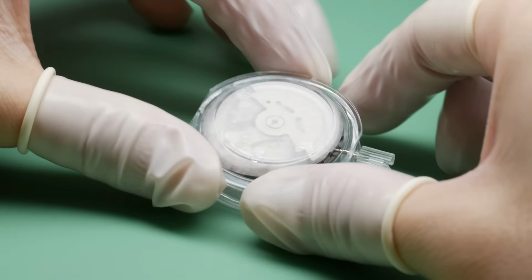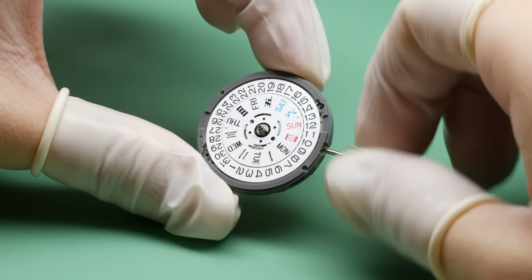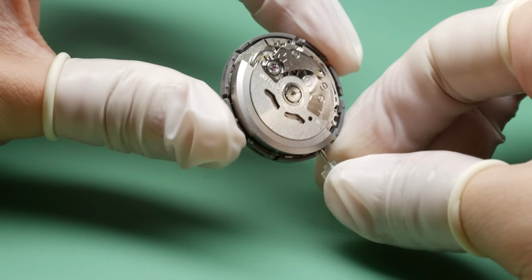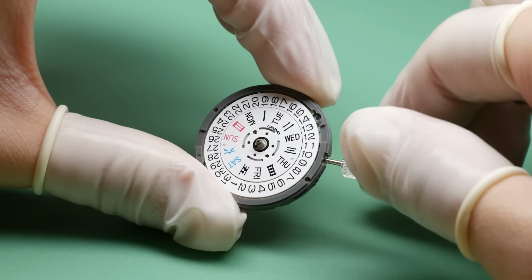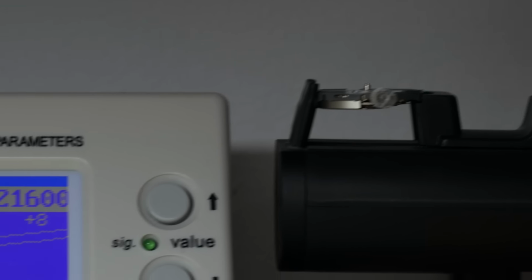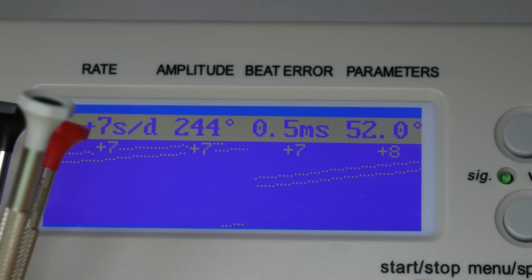Alright, so if you're familiar with my channel, you know that I like to start each build with the movement. Today, I'll be using the Seiko Instruments NH36 movement, which hacks, hand winds, and features a date complication. I start off by testing the operation of the movement, like the natural date change, quick set change, and oscillation of the balance wheel. I also check its timekeeping through my timegrapher, and this movement is running at around 5 to 7 seconds per day with an acceptable beat error.